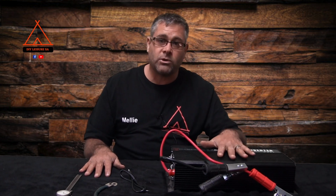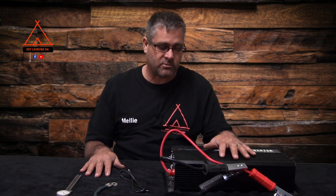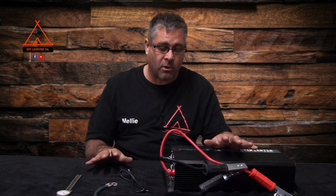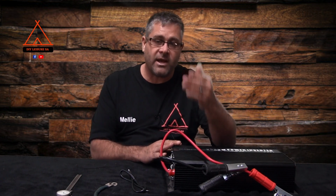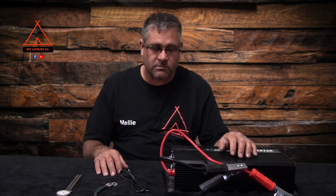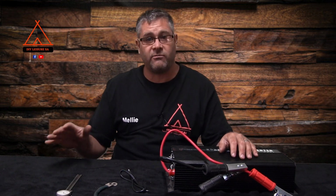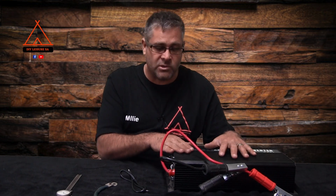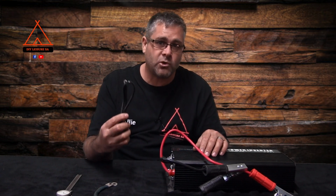So I went and bought a 2 kilowatt, a little bit smaller one. And that was working fine for me as well. But then what I did is I didn't plug it back into my house system on its own. I ran a separate extension to the Wi-Fi, and then from there to my TV and my fan and charging a phone or small things like that, so that I can get the most hours out of my batteries as possible. For that little amount of energy that I'm using from this inverter, the standard wires that come with it will be sufficient, I'm sure of it.